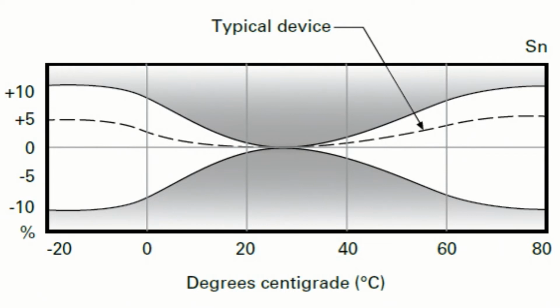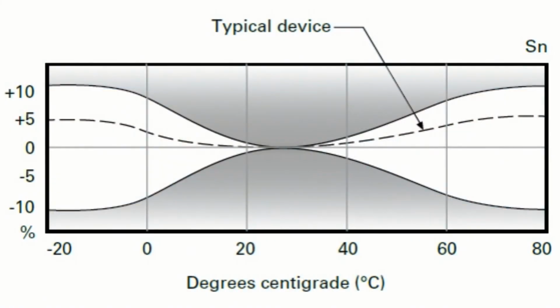And the electronics in a circuit like an inductive sensor can be sensitive to temperature. So those same international standards organizations that define the target characteristics to give you a rated sensing range, that 10 millimeter range to that mild steel target, they also define how much your sensor range can change over that temperature band, and that's what you see in that graphic. So the international standard is a sensor can vary up to 10% across that full temperature range. So a 10 millimeter sensor can range from 9 to 11 millimeters over that full temperature range.